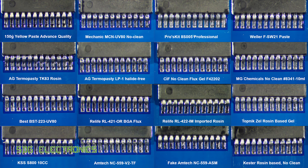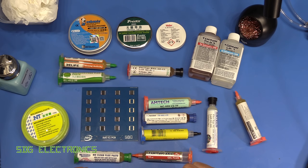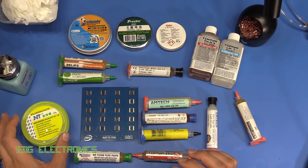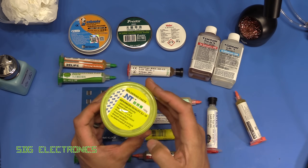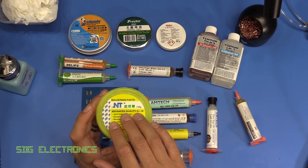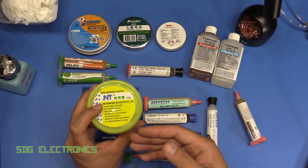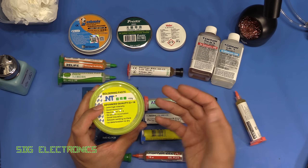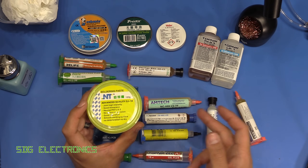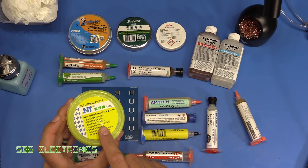Overall, all of them were able to do the job — we got really good solder joints on all of the ICs. It's just that a couple of them required a little bit of extra rework. For me, there were four that were behaving extremely well. Firstly, the Banggood tub of flux is probably the best value for money out of the lot — you get absolutely tons of it and it behaved really well. The only downside about pastes supplied in tubs is that applying them is a little bit messy and inconsistent, so you do need some kind of tool to spread it onto your components. You can use a flux brush or dispense it into syringes, but this one from Banggood was very good value for money and worked really well.